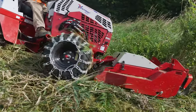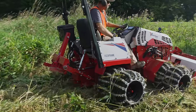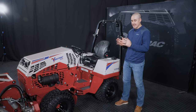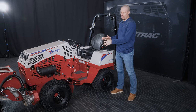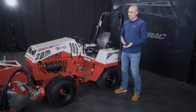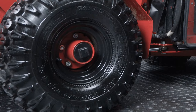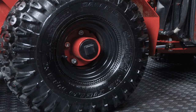Okay, the next thing about tires is probably the most important thing, is just dual wheels and their existence, what they're useful for, why we have them. We talked a little bit about them already, talking about tire pressure, but you can get dual wheels there. So each tractor comes standard with only four. You can add dual wheels later, and it's a pretty simple install. What it does is adds a second hub, and that extends out, and then that tire can thread onto that hub, so you just have them side by side.